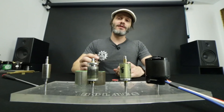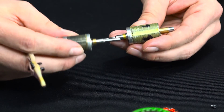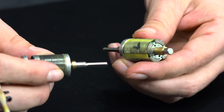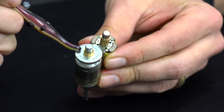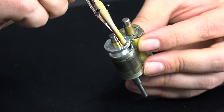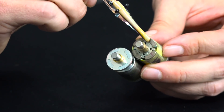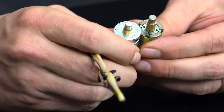If we look at some other designs of rotors, sometimes there are small changes. The one in my right hand is a Castle Creations newer 14 series — I believe this came out of a Slate — and the one in my left hand is one of our Polar Pros. You can see there's a little thing on the end here, and that's actually a magnet pickup for the sensors. Instead of the sensor board picking up directly off the main magnets, they have a secondary set of magnets on there, which can actually help under really heavy load to keep it commutating cleanly. We are actually working on a design for that on our own motors. When you open up a motor, you may find something that looks a little different, but they all work on the same parts and the same functions.